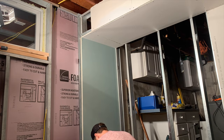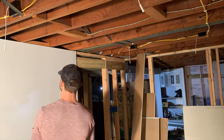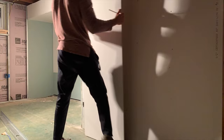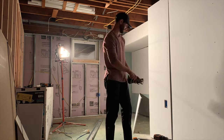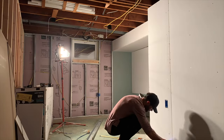You'll see here that this drywall is green. I got a lot of this drywall from a buddy of mine who finished a basement and had a lot of leftovers. The green drywall is just mold-resistant drywall, so I use that wherever I could. Here I am noting the general location for that electrical box, and then I hung the drywall at the top and used a router to actually scribe around the electrical box. They make a specific tool for cutting around electrical boxes — I'll link that in the video description.